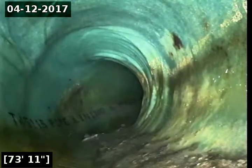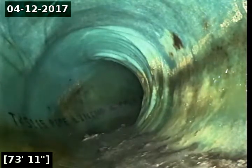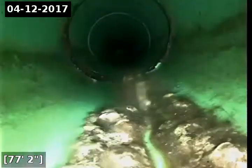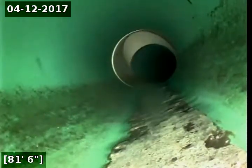Here we have a turn on the line. The line leaves the house at about a 45-degree angle and it appears to be headed north towards the neighbors' unit across the driveway. Then it makes a 45-degree turn and heads straight out towards the street. As it's headed straight out, we have a transition into PVC green bell pipe, and right after this transition we have a little hub and piece of pipe and then an actual T junction.